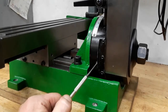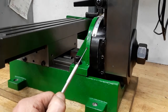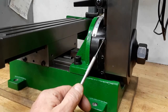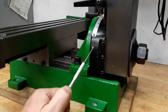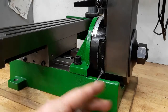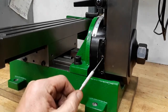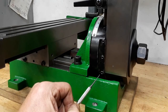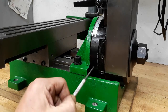But I am lazy, and for that approach I would have to disassemble the mill, drill a couple of holes, thread them, and then make the part. So instead, I looked at this flat surface area with the three existing set screws - actually deep set screws. My thought was to remove one of the screws, make a small part that mounts using that threaded hole, and have a screw on that part working against the frame. Why not try this?